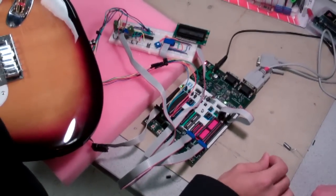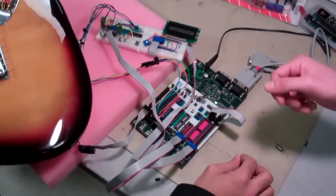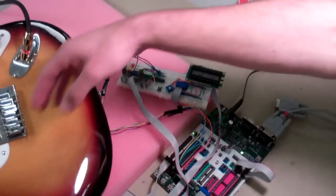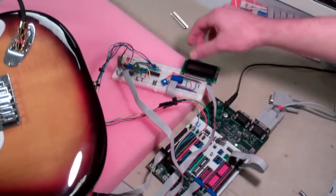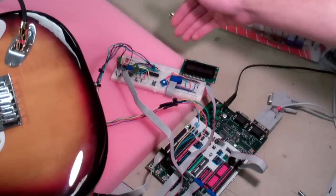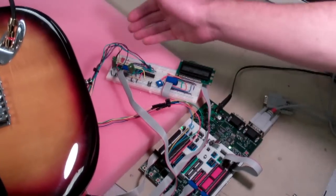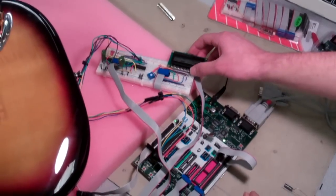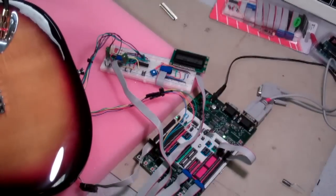The system is very quiet — no 60 hertz noise, no junk, no crackling. We found that if you place the wires that bring the pickups into the analog multiplexer close to the LCD screen, a lot of times you get noise and a 60 hertz tone coming out. But if we keep the wires far enough away, there's no noise. So if we were to actually put this inside the guitar, we'd want to keep it at least six or seven inches away.